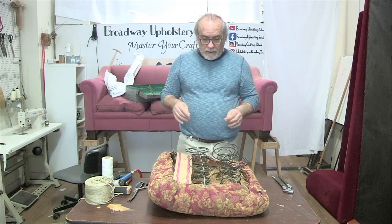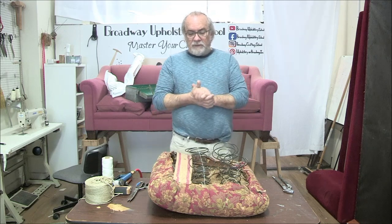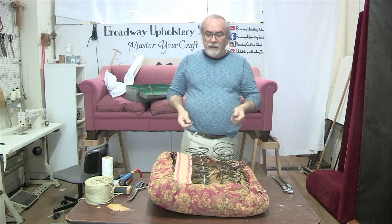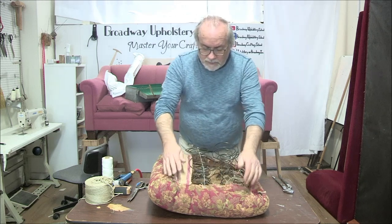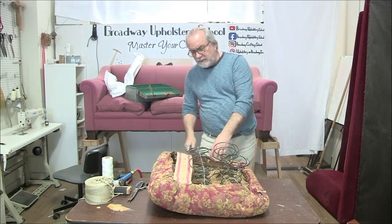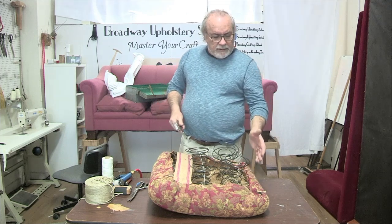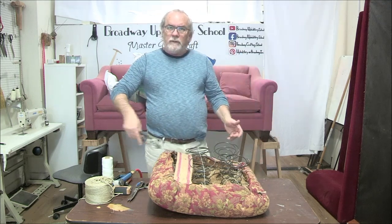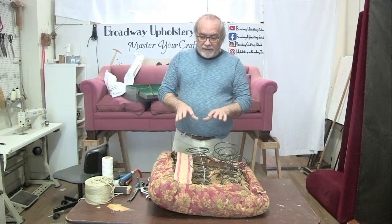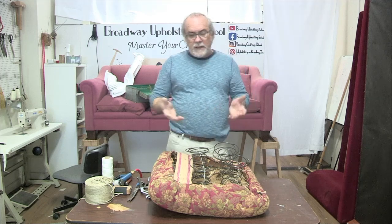So at this point for you homeowners, once you get it 4-way tied, I suggest that you find a heavy piece of burlap, or a piece of burlap, if it's not heavy, you double up on it, and then simply tack or staple one side, and on the other side, make sure you try to stretch it with a pair of pliers and tack it. And do the same thing over on this side, fold it over, tack it, and then on the other side pull it with your pliers. Try to get it as tight as you can, but it will obviously still be a little bit bellied out, which is good.